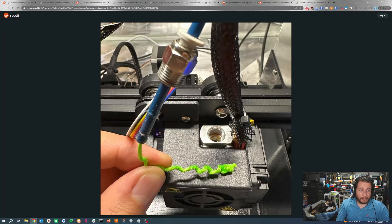This one's a pretty easy fix, but a really easy trap if you're new to this kind of thing. While it will eventually cause problems, you might see it printing okay for a little bit until it builds up enough back pressure to cause the filament to look like a big curly cue. This will also be a problem when you try to pull the filament out because that filament plug will not allow it. So if you seat the Bowden tube in, life will be good. After you leave a comment or two, like the video, and stay safe out there. Don't forget to call your loved ones, and as always, keep making awesome.